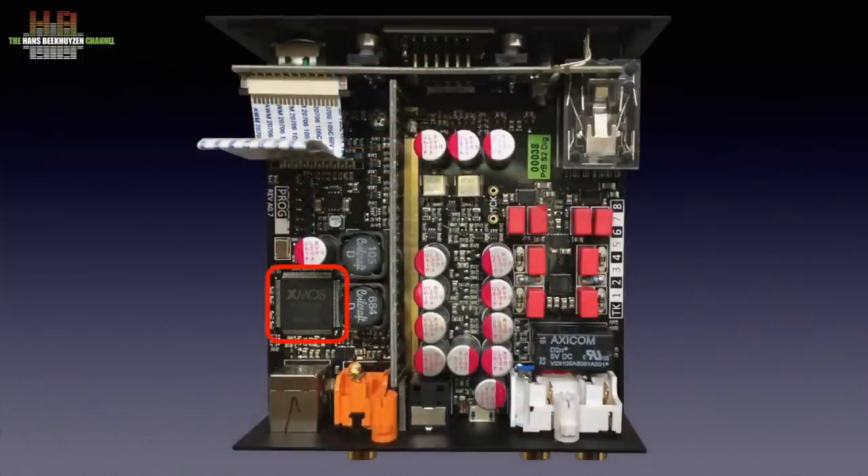Let me start with the four-layered gold-plated PCBs that are designed to provide extra shielding. The XMOS 16-core processor not only handles the async USB input but also the MQA unfolding. Pro-Ject claims to have filtered the USB input to the extreme, and I suppose these coils take part in that. Behind that is the power circuit for the digital part. A vertical PCB provides shielding between the digital and the analog part. There is a separate power circuit for the clock oscillators — indeed there are two of them, specified at 100 femtoseconds.